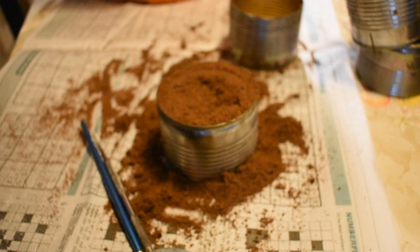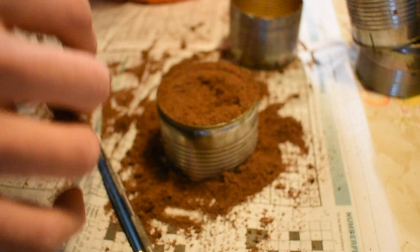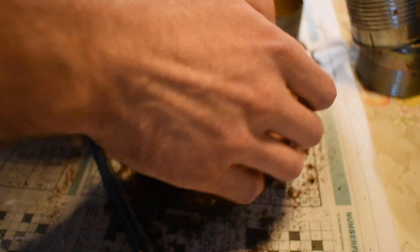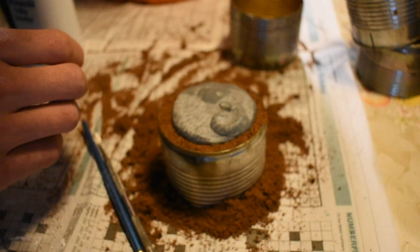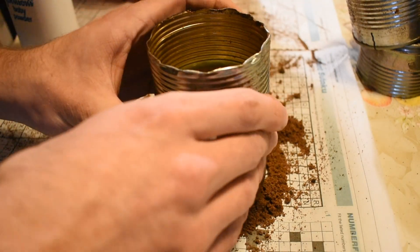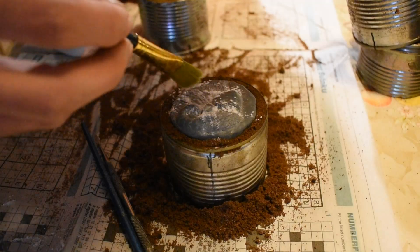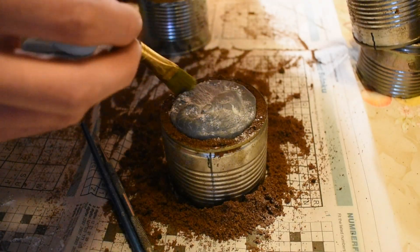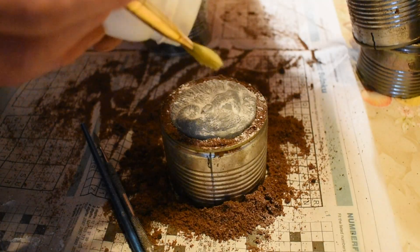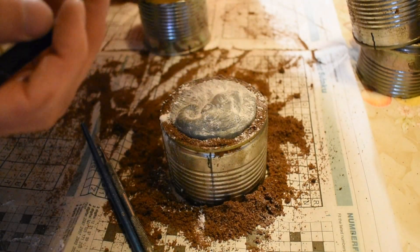After you've pressed your piece into the sand, you want to put some talcum powder on the sand that's visible around your model. Press your model in quite hard so that it hopefully takes the imprint. You'll want to put talcum powder on both sides of the model. I measured to make sure they still fit together once you've pushed all the sand in and also to ensure that your lines meet up. Put some lines on your tin cans to ensure that when you take them apart and put them back together, you'll get the same orientation of both sides.